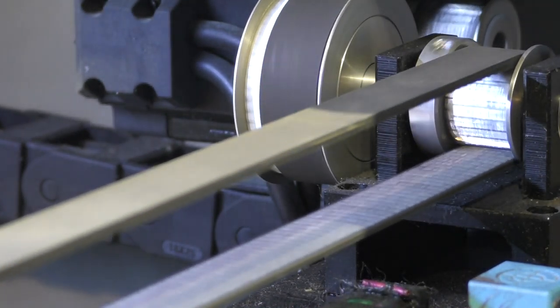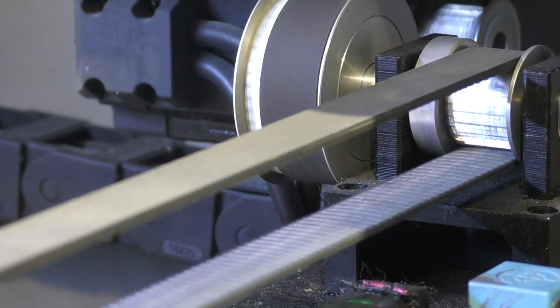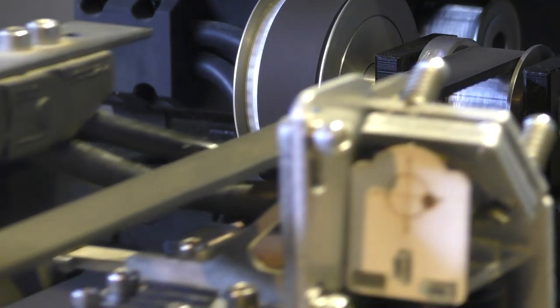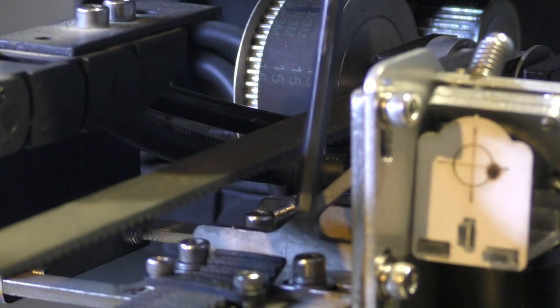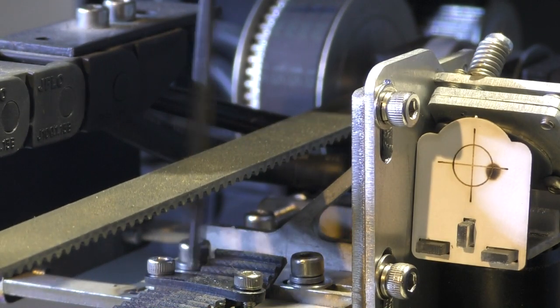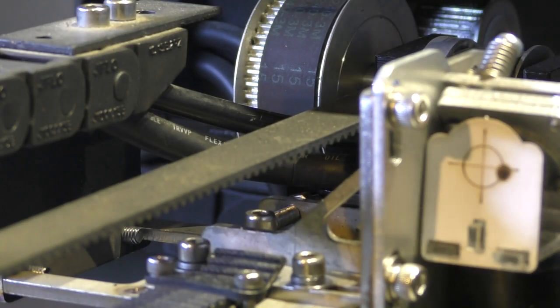Let's get a target burn at the other end as close to mirror 2 that I can. Now we'll bring it back. And this is the alignment burn. There we go. I don't think we can get much better than that at the moment. Remember, we're not worried that it's miles off centre, because all we've got to do now is to grab hold of these little screws and pull it forward on the adjustment.